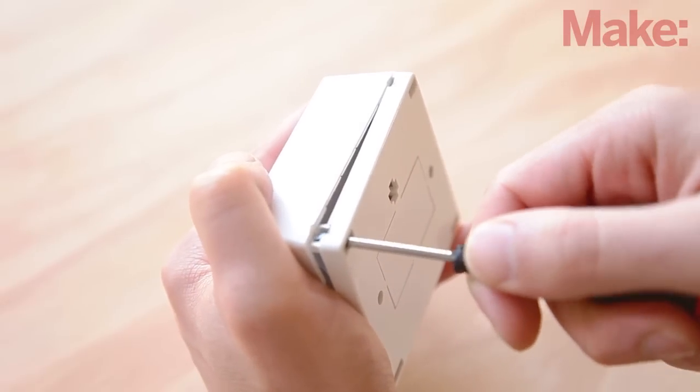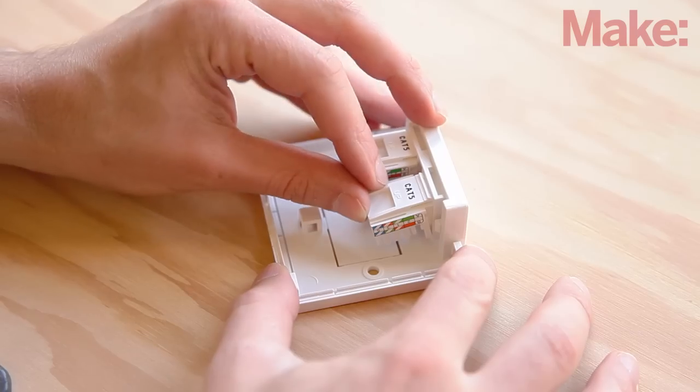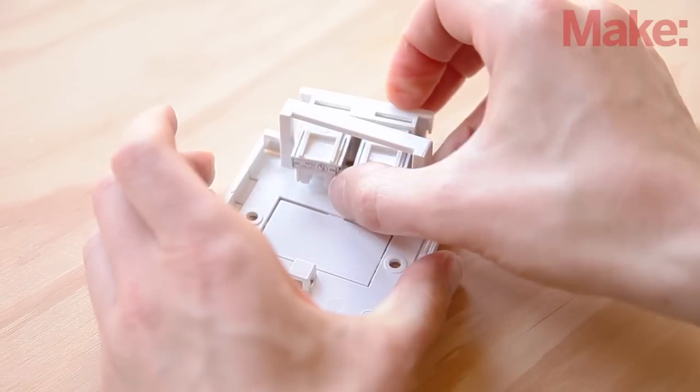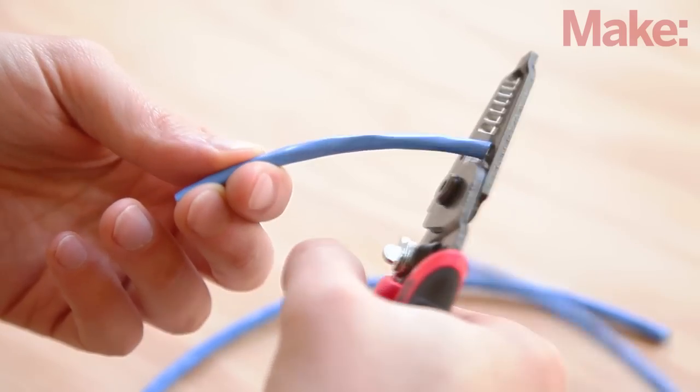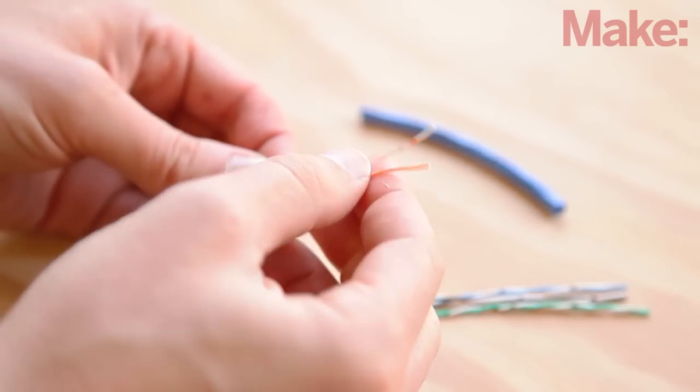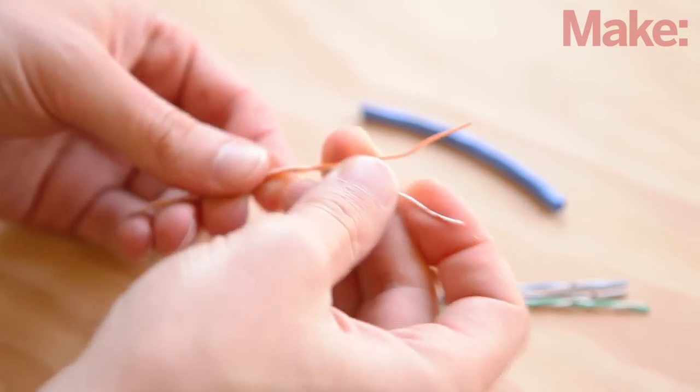Use a small screwdriver to snap the cover off the box. Snap the two jacks into the front panel and pop the front panel off the base plate. Now cut a four inch piece out of an old network cable. Remove and discard the outer jacket and any reinforcing fibers inside. Untwist the wires in each pair.